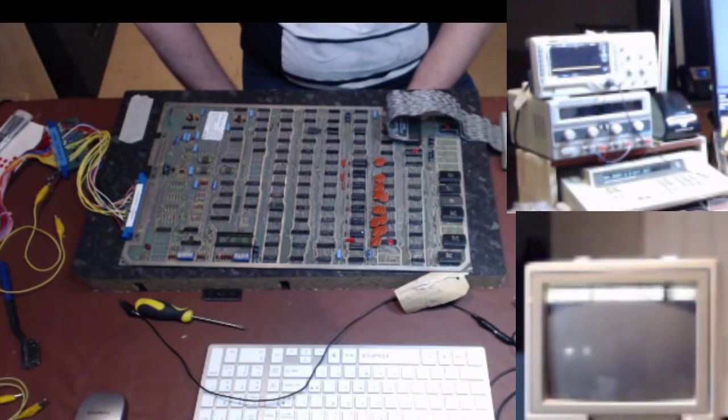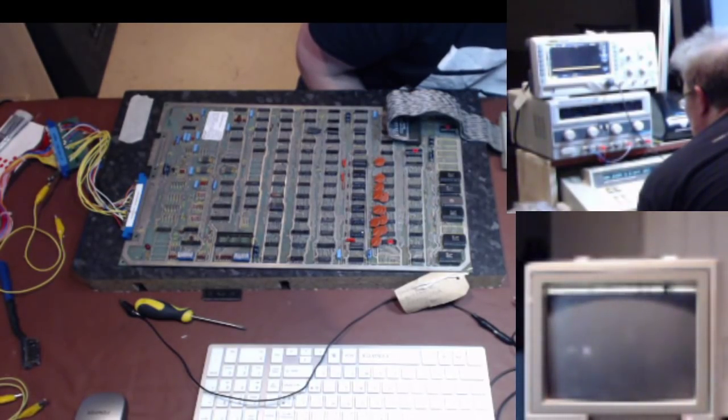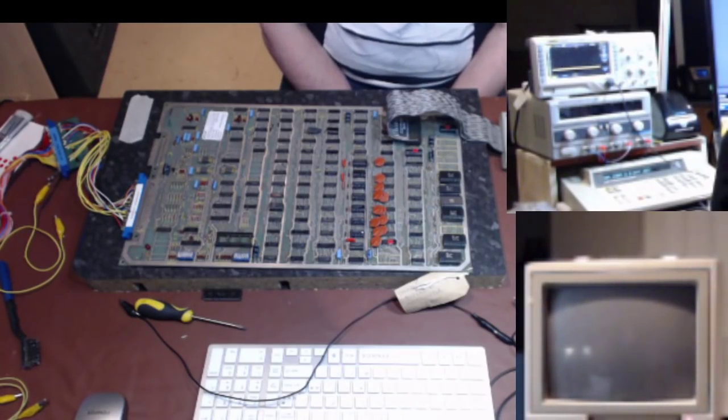I think we might actually really have a couple of bad RAM chips, but it could be more likely the data bus issue was the problem. So I'll have to just let it run. This will take a minute. I was expecting patterns, but I suppose if there's nothing in the colour palette registers, then it won't write anything, will it? This takes a few moments.